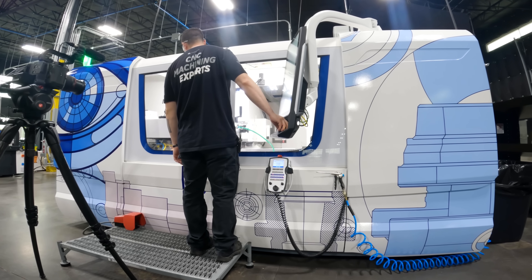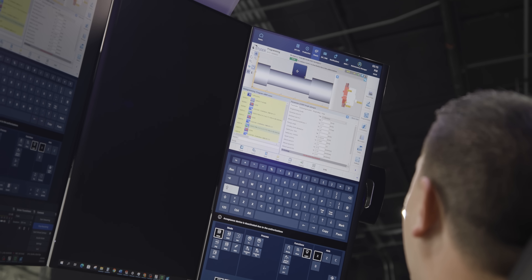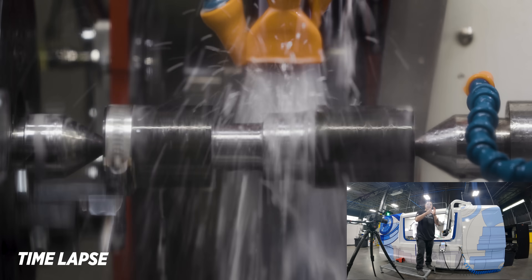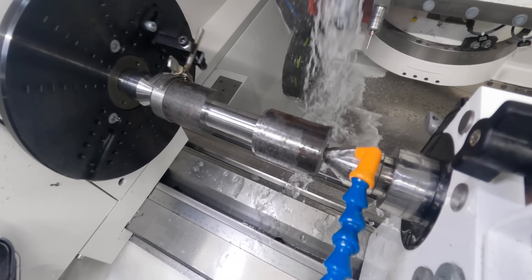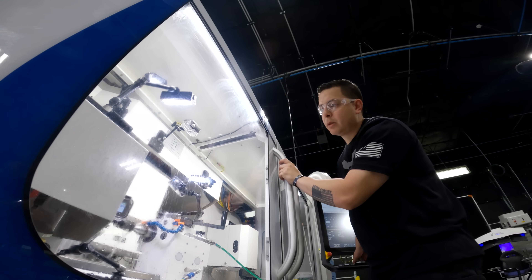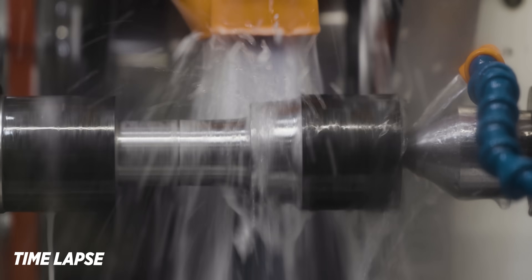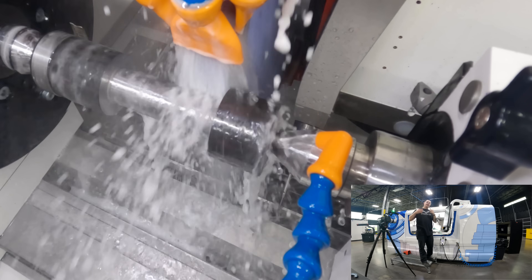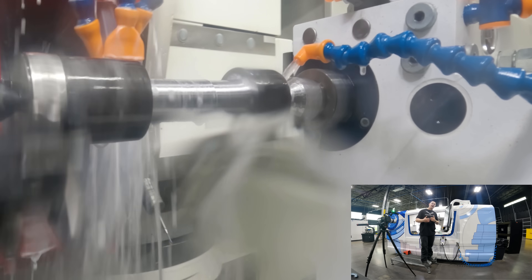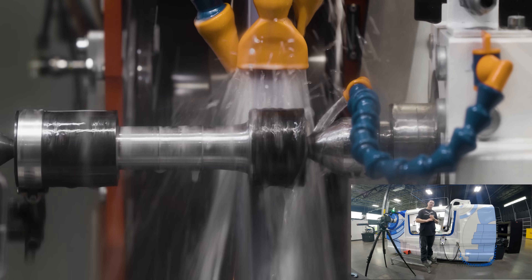After we've finished cutting the middle, we're going to move to the right and start grinding to the right-hand side. I'm plunging right in the middle and now I'm going to move over — that way I create a space so I can get my wheel in there to do an angle plunge on the left and right side. The wheel moves a little bit more to the right, going right down the middle of that part and really opening it up outwards. We're going to go back with a finish wheel and clean up that handle so we have a good clean finish all across the part.